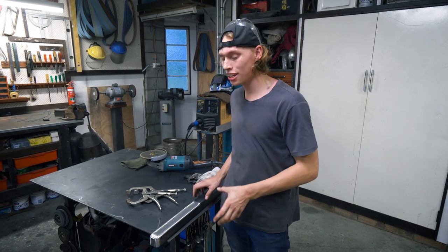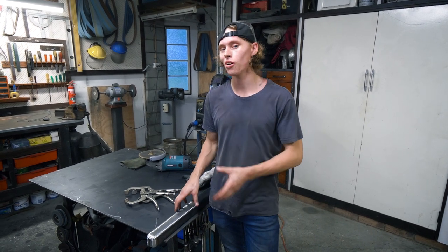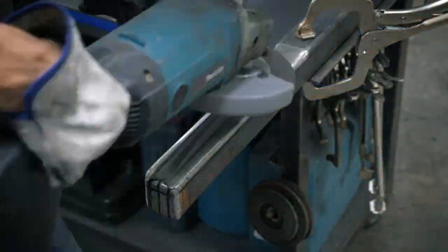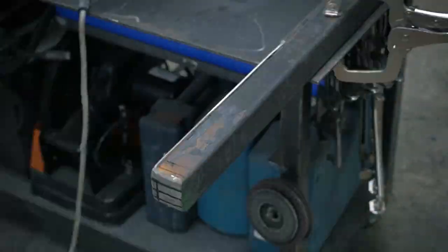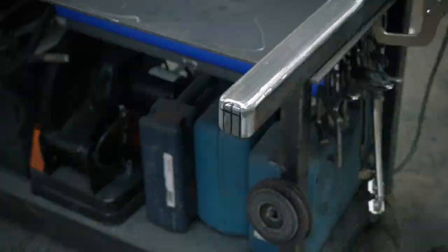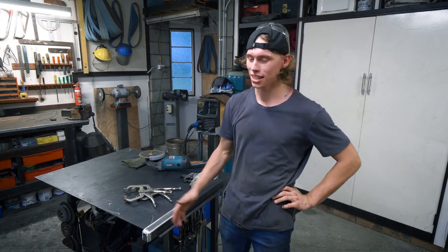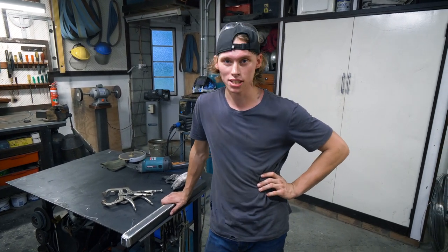What I should have mentioned earlier is the material we're using for the top of our T-stake. This is 50 by 50 millimetres of 1045 steel, which is excellent for making hammers — sort of like what a stake is going to be used for. It's going to be hammered on, pretty much abused and used, so we want to make sure it's going to stand up to that.